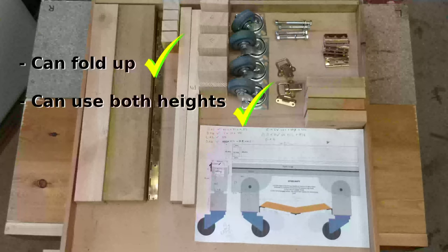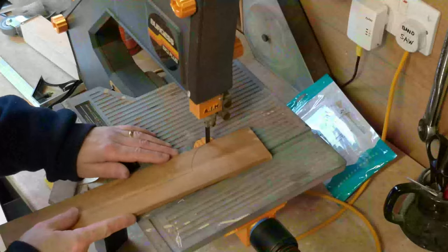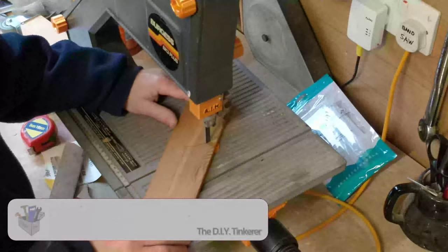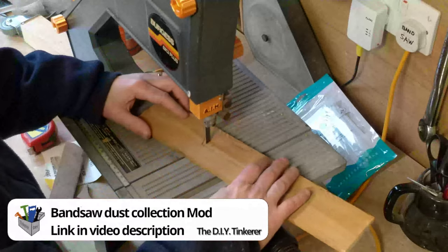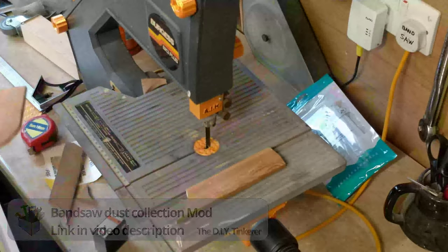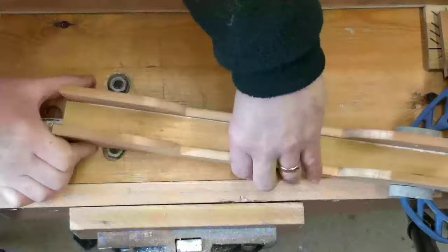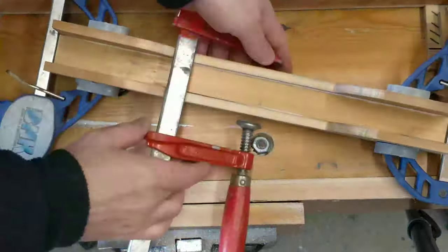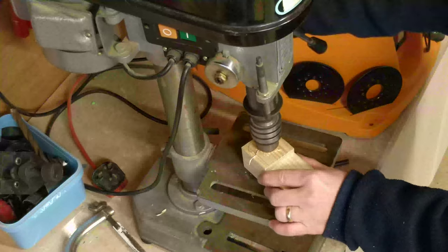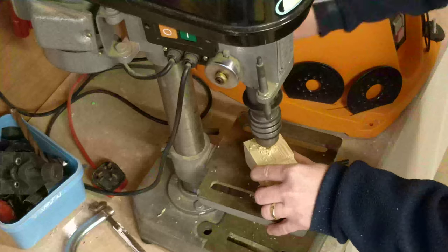When the workmate is in use and not on its wheels, it's solidly on the ground. I've already cut the parts to size but they all need shaping. There are four of these parts — they will become the sides that the legs for the casters will be mounted on. I'm using my old bandsaw that I rescued and restored and then updated to add dust collection. I glued these sides to another strip of wood I'd ripped to size using the bandsaw. This will form the main body of the wheel mechanism. These are the legs that the casters will be mounted to. They need drilling so they can be connected to the sides using a bolt, and rounding over so that the mechanism doesn't foul.